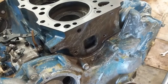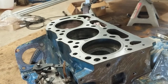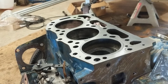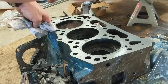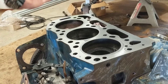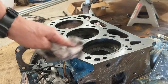It was JB welded back. I sanded this — began with 80 grit and stepped my way down to finer. The reason you want to do that is the 80 grit will get it flat, it'll cut the high spots. Same thing with body work — you start heavy and work your way finer. If you start with a fine grit it'll contour and possibly get worse, but if you take a coarse sandpaper, cut it all flat, then work your way smoother to a finer and finer cut, you'll get a flat surface. This is just a Ford 201 diesel.